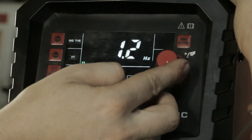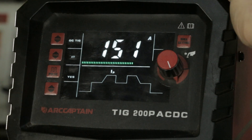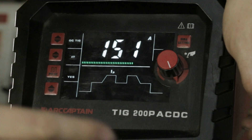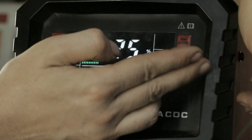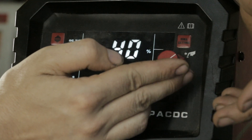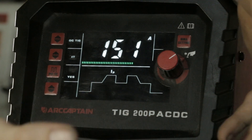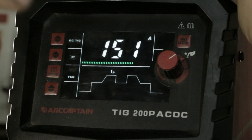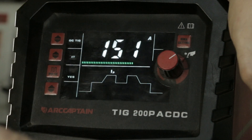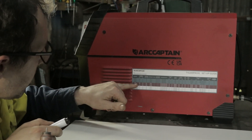So our hertz is our speed. The next is percentage — you're now setting how much of that pulse you're on the high side. What percentage of that 1.2 seconds you are on the blast. The higher this number, the more power you're going to output. I live somewhere between 25 and 35. Once you go over 40, you start to cancel out any benefit from using pulse — you might as well just be welding in straight DC. The beauty of pulse is that you're only ever on that high voltage for just a fraction of a second — just enough to melt the filler wire and the base material together, and then you're back to the low amperage. The quicker you're doing that, the less heat you're putting into the material.